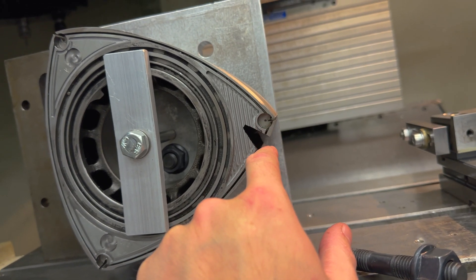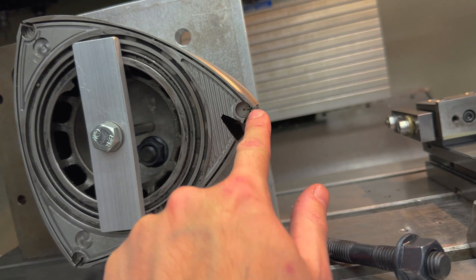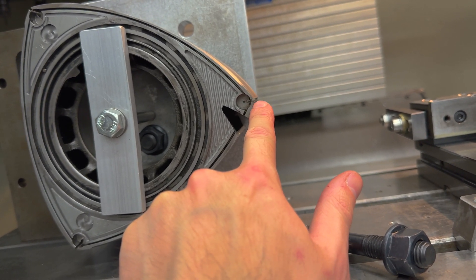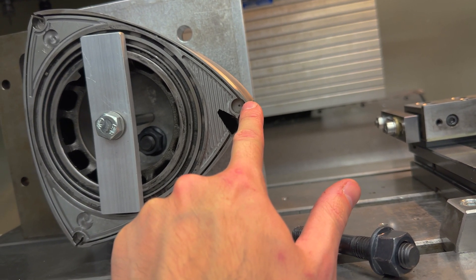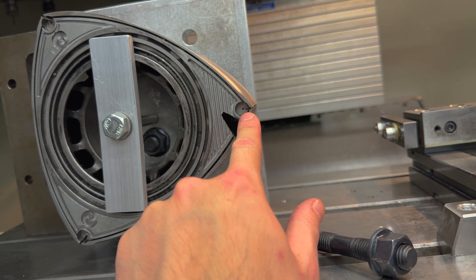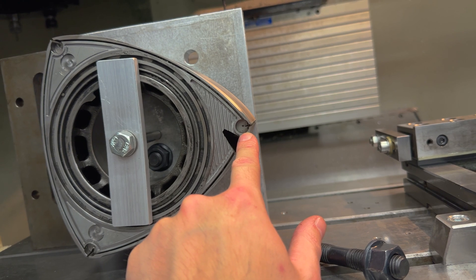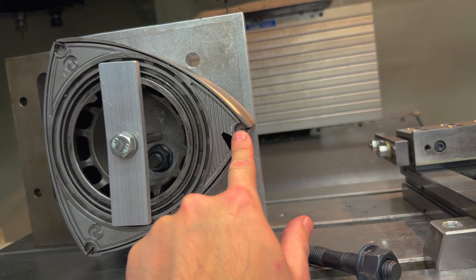I'm going to be mounting it sideways, rotating the jig 90 degrees, and clocking this point - the pocket - by using a two mil slip or a buildup of slips to get pretty much on the tolerance. Then using a slitting saw to come through the gap, which hopefully at two mil should cut dead on - which is literally a few microns above the top or bottom limit. So that'll work a treat.